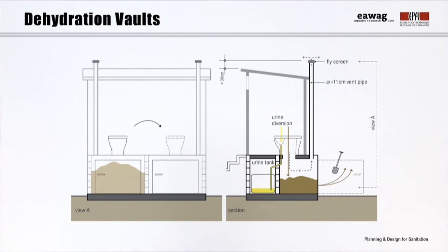Dehydration vaults are watertight alternating chambers usually built above ground to collect, store, and dry feces. One chamber is in use while the other dehydrates. When feces are not mixed with urine and other liquids, they dry quickly. In the absence of moisture, organisms cannot grow, pathogens are destroyed, and smells are minimized. This technology requires the use of the UDDT as a user interface. Urine is diverted and collected in a storage tank. To prevent flies, minimize odors, and encourage drying, a small amount of ash, lime, dry soil, or sawdust should be used to cover feces after each use. Ash and lime additionally raise the pH, which causes pathogens to die off.